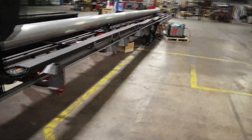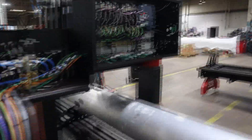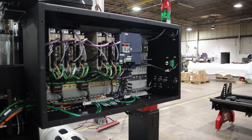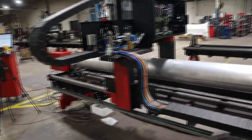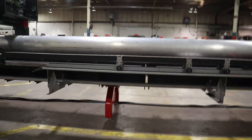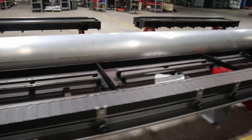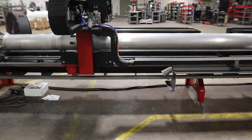You can see how the reverse cable chain works: the cable chain is coming out of the back of the machine. You can see where we've added extra amps, and that blue thing is the VFD — variable frequency drive — to drive the spindle. We also had to add a resistor to take the energy out of the spindle when you wind it down. The new cable carrier is very low profile — the majority of the part sits above the cable chain. This was done to minimize the dangers of loading with a forklift or overhead loader.